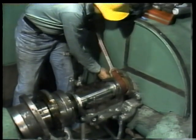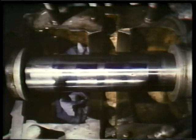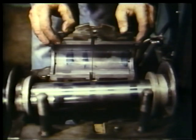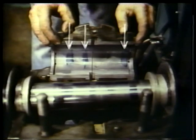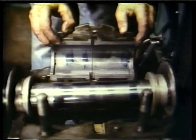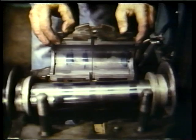We'll be able to check both the shaft and the bearing to see just where the high spots are. Looks like we've got some problems — each of the breaks in the pattern corresponds to high spots on the bearing; the blue places in between are spots where the bearing didn't touch the shaft. After hoisting the shaft and removing the bearing, we can compare the two patterns. The blue places on the bearing match up with blank spaces on the shaft — on the bearing, the blue places are the high spots. Since this is obviously less than 80% contact, we'll have to scrape the bearing to remove the high spots.